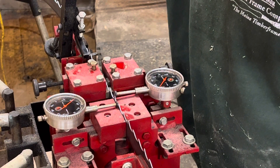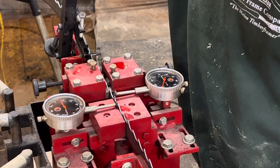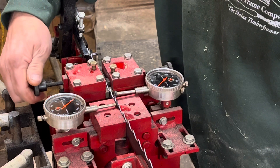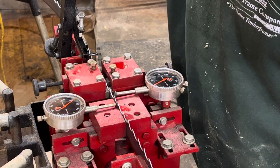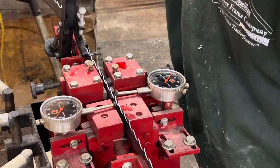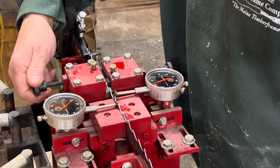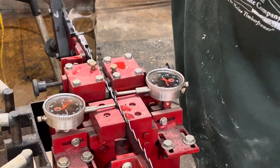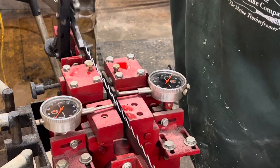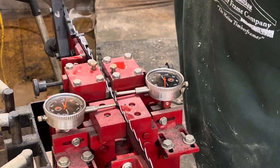We'll try another tooth. We're at 12. A little more. We're at 20, just a hair more. We're at 22. A hair more over here. So they were both set at about 22. That's how quick it is to set this machine up. And then you're going to see that both your left and your right have equal set.